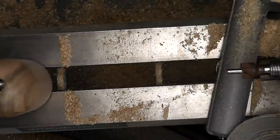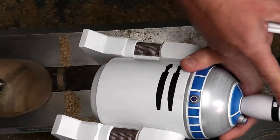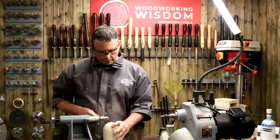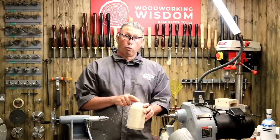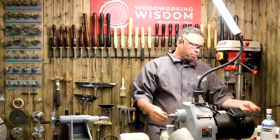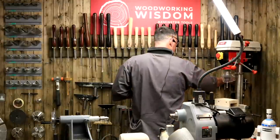And the flex we're using on the plastic lamp holders, the switch lamp holders here, we're using white two-core flex. But on the brass ones, any metal switch lamp holders, then you need the three-core flex. All right, so now we've got holes, we can clean up both of the hole points. Okay, so we can take out the drive center from there. We don't need all that power now to drive the piece. So we're popping back there and let's go.